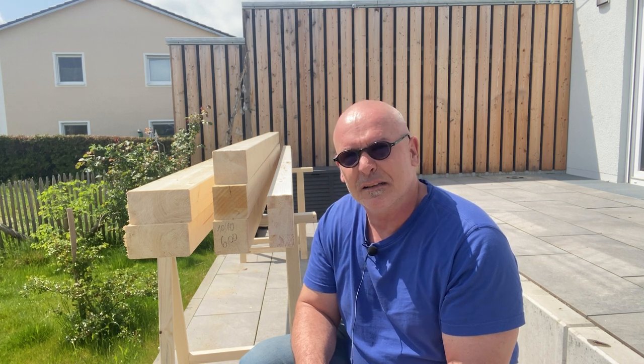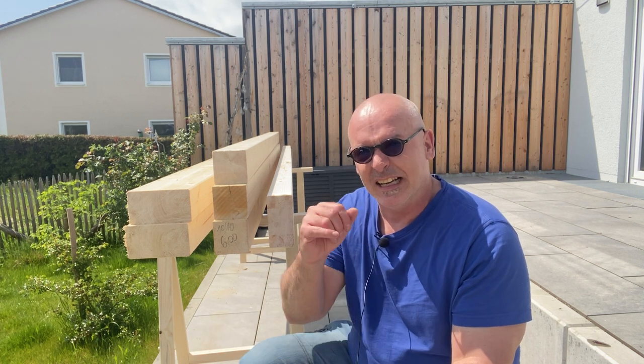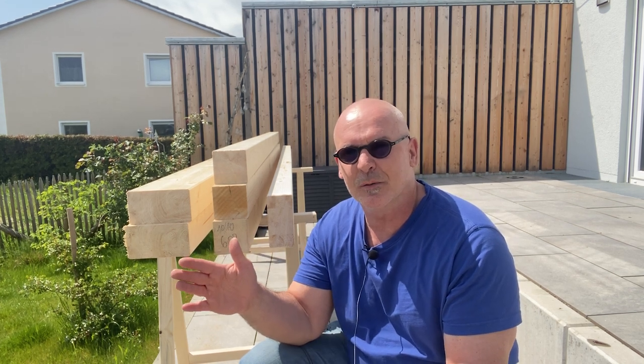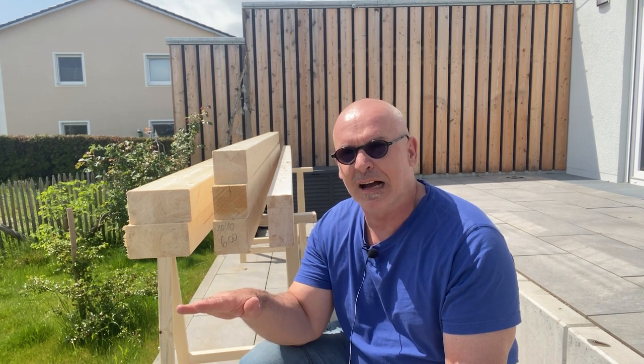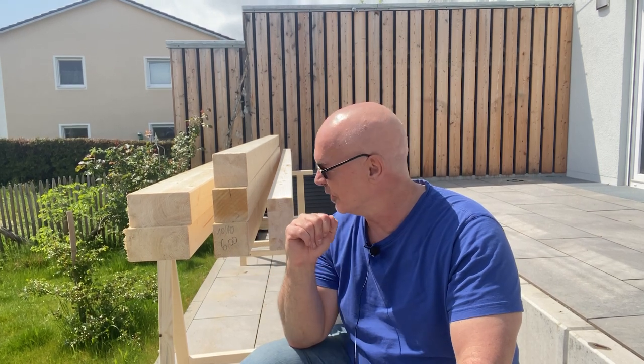We have 3.40 meters terrace width, giving us a rafter spacing axis measurement of 86 centimeters. The Stegdoppelplatten come in two standard widths: 98 cm and 1.20 m. I chose 98 cm, partly to keep the span not too wide due to snow load, though I'll have to cut them all to length. That's no problem with the right saw blade, which I'll show you later. Wood construction without screws is really no construction at all.